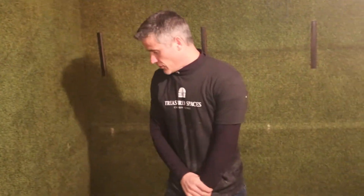For liquid water when it's raining, you've got cracks in your foundation, you've got water coming in all around — especially if your gutters are overflowing, you don't have proper downspouts, or they don't run to a good place where the water can get away. Maybe you don't have any gutters. Those can all contribute to it. That water is going to find its way through this paint, through this epoxy, through all this stuff. So what are you supposed to do?